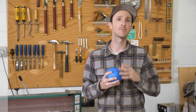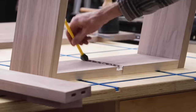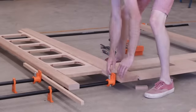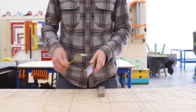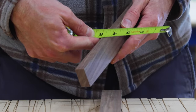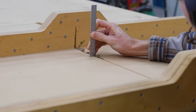There are a lot of situations in woodworking and furniture making where a half lap or cross lap joint makes a lot of sense, and one of the trickiest parts is finding the exact halfway point through the thickness of a piece so that when both sides of the joint are cut they come together perfectly and add up to the same thickness. The most obvious approach would be to measure the thickness of your parts, divide that in two, and set your saw blade to that height.